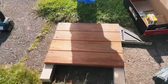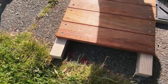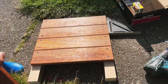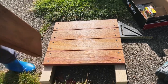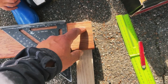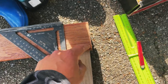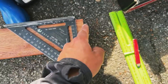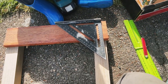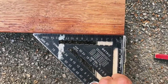I've got my wee apprentice helping me — he's helped me put all the screws in, which is pretty cool. I've got two boards I'm using as the baseboard, and that dictated how wide I'm going to make this. A real easy way to mark all the screw holes — similar to when you do decking — is to measure 20mm in, then 20mm and 70mm, and do the same on the other side, just to make it nice and simple.